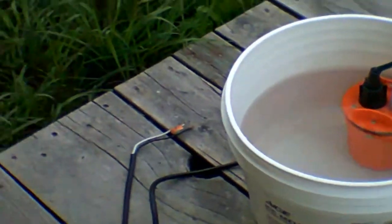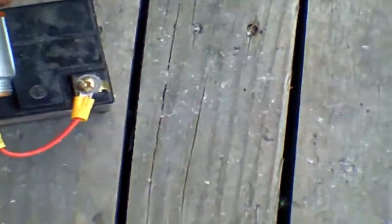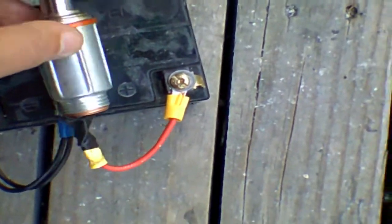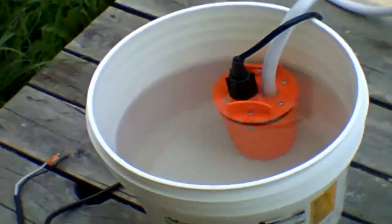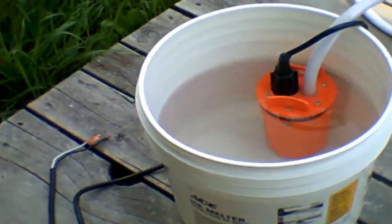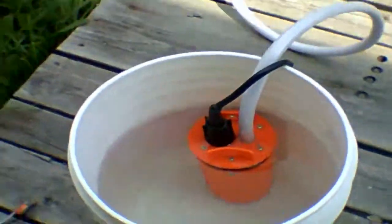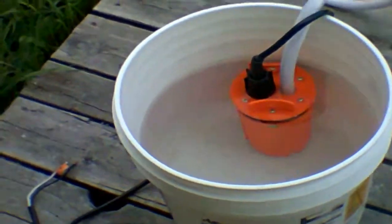The battery I used it on is almost dead. You can hook this up to your car battery, you can hook this up to your solar, or just take a little battery with you — I don't know how long that would last. Like I said, you can see the size of this battery — the cigarette lighter with the end in it is actually bigger than the battery is across wide. So it seems to work really well. Now, if you have solar and you want to get a water pump for like a river, lake, or a pond, this will work on your solar system. Depends on how many solar panels you have. I'm not going to hook this up to just a 100 watt solar panel, but I have seen kits that have one of these pumps, a small 15 to 20 amp solar charger controller, and one 100 watt solar panel. So I'm pretty sure this will work with one solar panel.